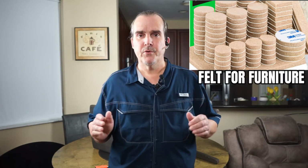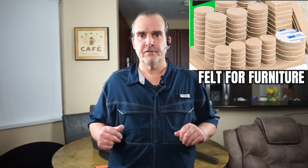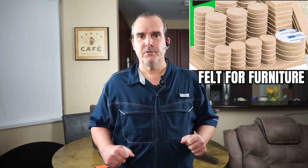Well, we almost forgot to put the felt on that couch. On all my installations, I think one of the most important things that we do that a lot of other companies don't do, and I insist on doing for my customers, is I put protection on the feet of the furniture as I go. I don't put anything back onto the completed floor unless I put felt on it.